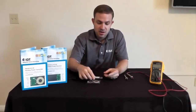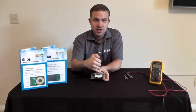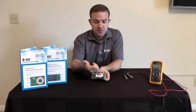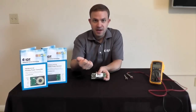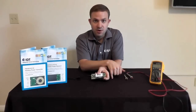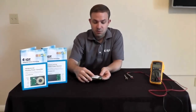To make these boards work it's really easy — you just plug it in, pop the other board on top, and you'll actually notice a green LED. We put that there just so you can see power transfer; it's a very small load. You're welcome to remove that LED when you put it in your final product. As far as using this board, it's very simple: we have a V-out and a ground, and it's a 5.3-volt output. You can plug that into anything in your system and you're ready to go.